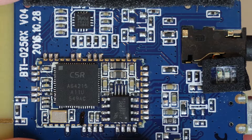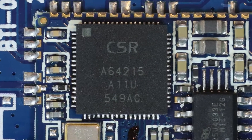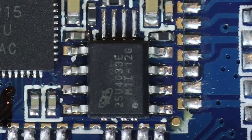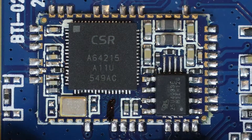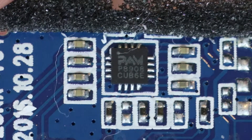I've quickly done a bit of research on the chips on this main board and the Bluetooth module. The Bluetooth module has two chips — the main one is a CSR A64215, which is a system-on-chip that deals with Bluetooth; it's compatible with Bluetooth 4.2. The other chip on that board is a memory chip. These Bluetooth modules you can buy separately; they've got the 64215 chip, a memory chip, and some supporting components, breaking out to a castellated edge. It does look like it's possible to reprogram these boards so they behave differently — it might be possible to reprogram the buttons and actually disable the track-skipping altogether. The tiny square chip on the main board is a small amplifier, obviously used to amplify the audio for the headphones.